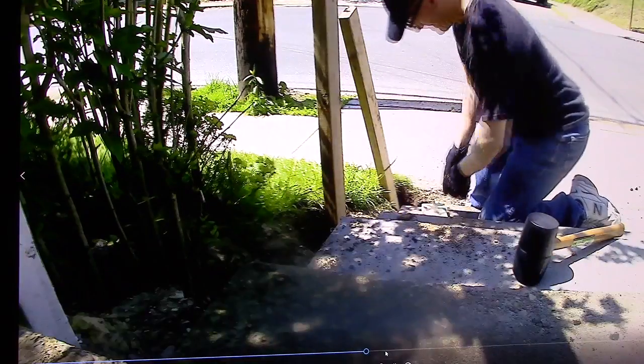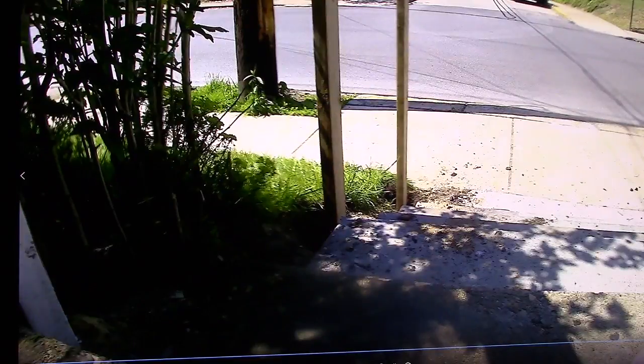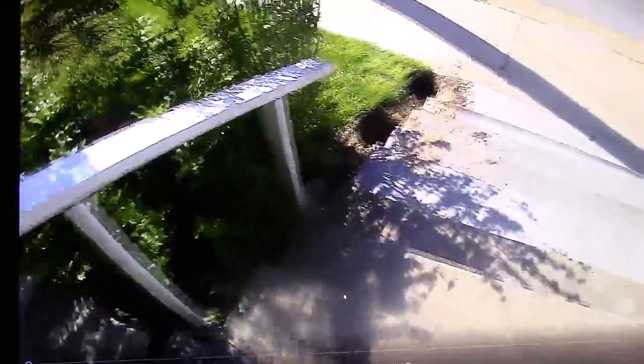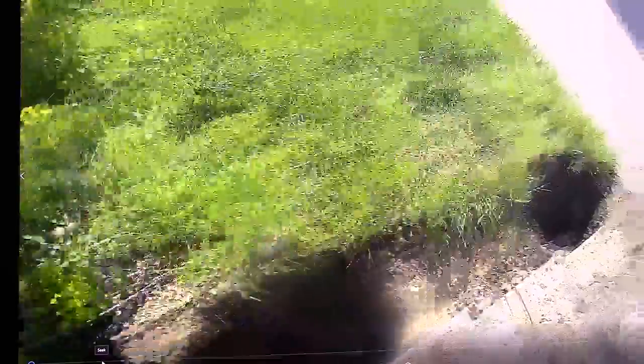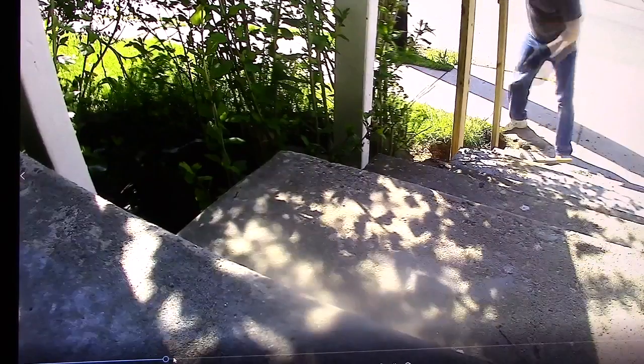The post is staying vertical all by itself, which is nice. Then I realized I thought I had a bag of concrete in the basement and I didn't, so I had to take my perfectly lined-up posts out and do it all over again. This time I used a little block of wood — a two-by-four piece — to measure the distance away from the edge of the steps as a spacer, because I knew it wasn't going to be absolutely perfect. Using the rubber mallet to bang it in and throwing rocks in the hole to keep it lined up.